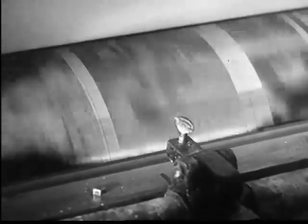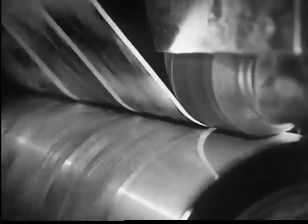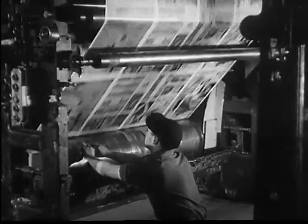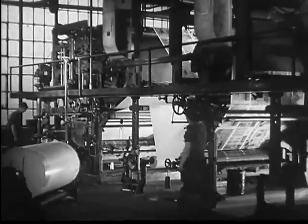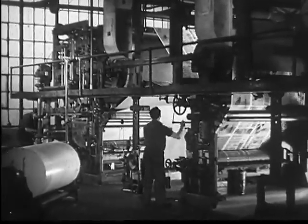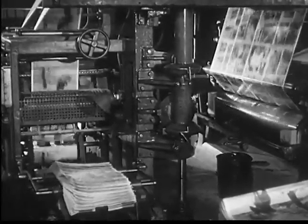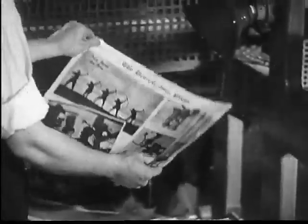The cylinder is put on the press and turned through an ink bath, which soaks the entire surface with ink. A bar wipes off the cylinder, leaving ink only in the holes. Paper is forced against the cylinder by a rubber impression roller. The rubber forces the paper into the low spots of the copper cylinder, and thus transfers the ink to the paper. So the art of engraving, in all its phases, has made it possible for us to reproduce faithfully the handiwork of great artists and photographers, and to tell the story with fidelity in pictures — pictures translated into heights and depths on zinc or copper, and transferred onto paper with every smallest detail exactly reproduced.